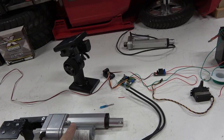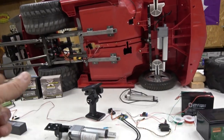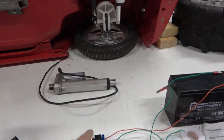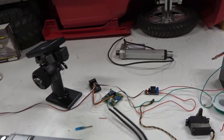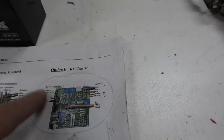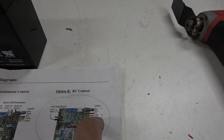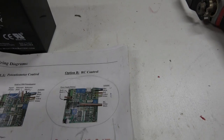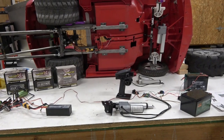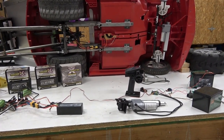The board will handle up to 24 volts, so you could really make this thing faster. If the steering response isn't fast enough you can put more volts to it, but it's got to be separated from your receiver. Just follow the instructions you can download online — it tells you everything: power coming in, RC going out, power going out to your actuator. I'll put links in the description to all of these products so you guys can make yourselves a rad brushless power wheels conversion. Thanks for watching!